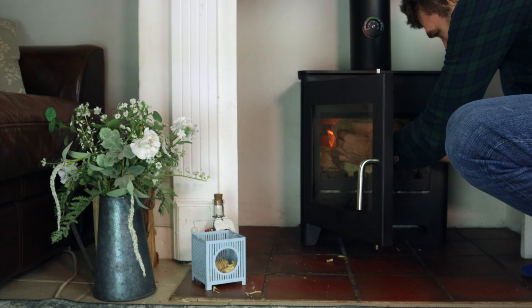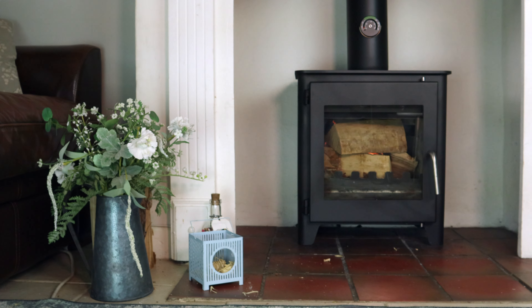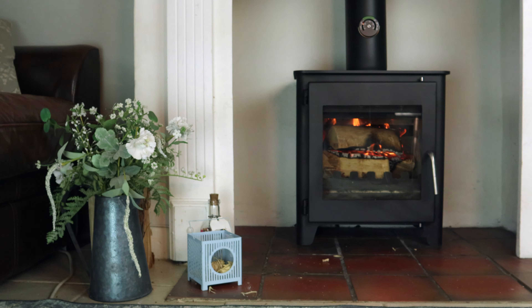This is a really easy stove to light. It's a bit of a rarity because it's a wood burner with two controls — a lower vent and an upper vent. Because it has two vents, you can close the door straight away and just leave them both open. Up to temperature in no time, and we only lit it with three logs — no kindling, no small bits, three logs and one firelighter.